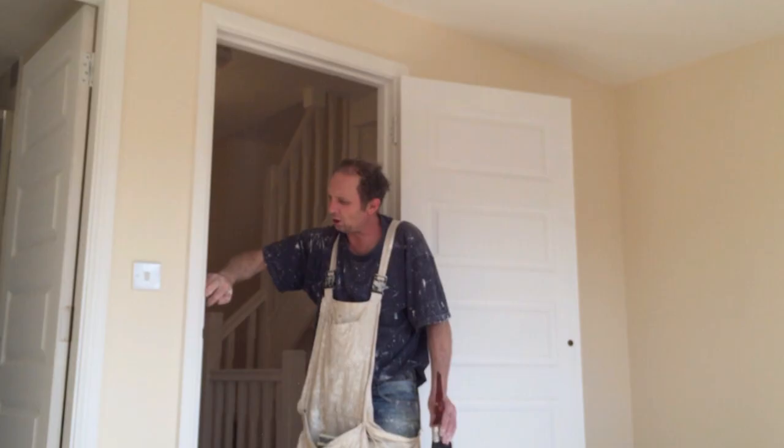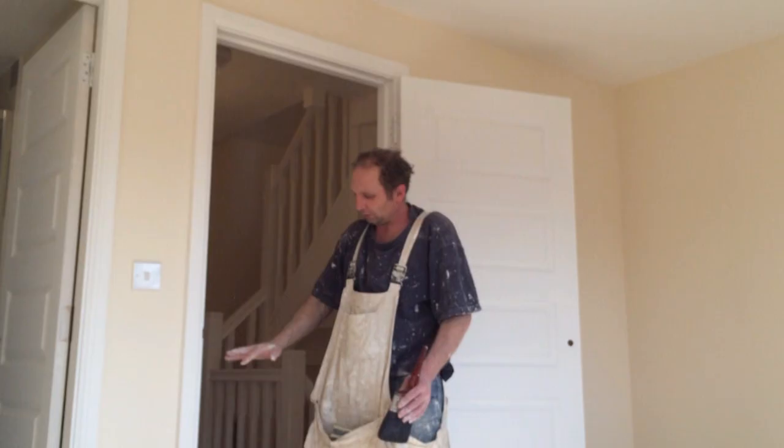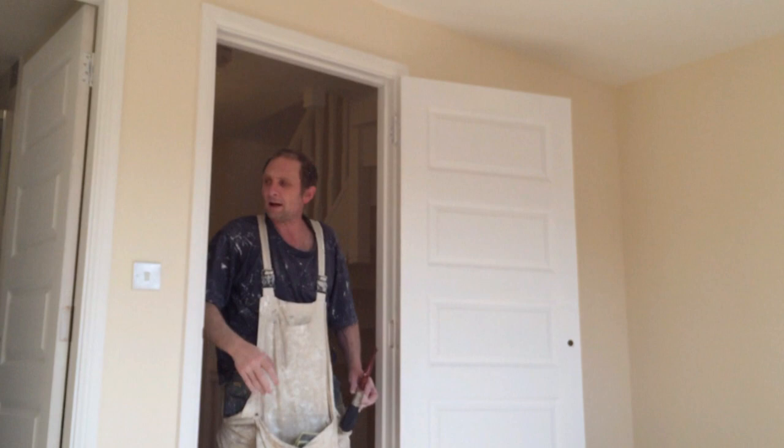either before you undercoat or at this stage, if you find any gaps in the architrave, you'll need to gun fill them. I've actually done that at quite an early stage already. If you still come across a few gaps around here on the architraves, gun fill them now, so they're going off ready for the satin. Right, so okay, let's put the final coats on.